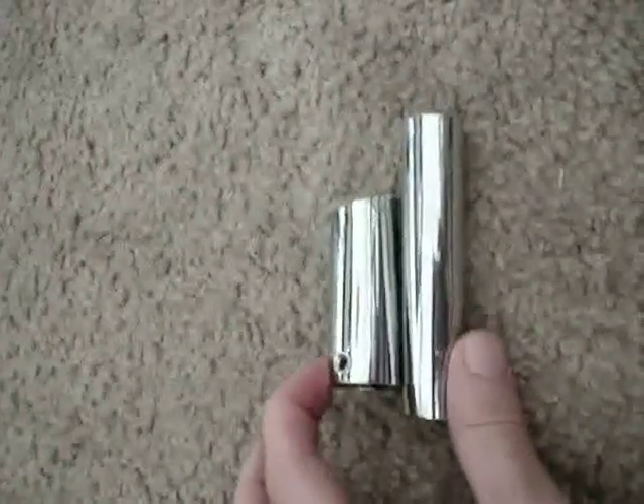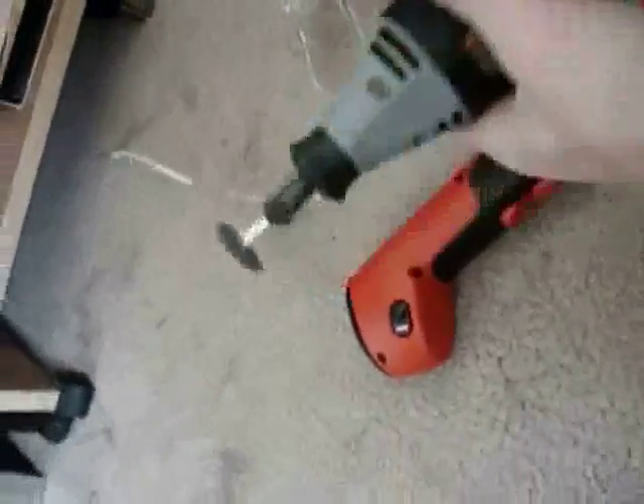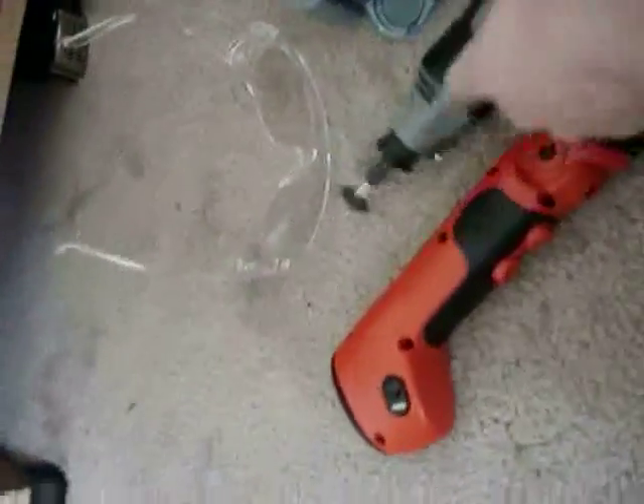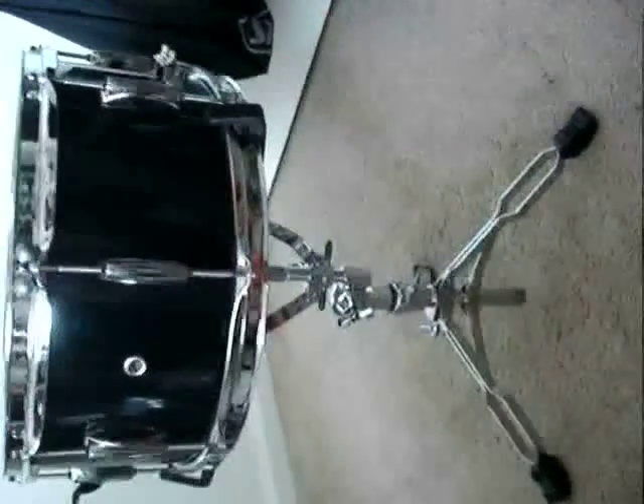So if you're looking to spend just an hour — maybe even less if you've got the right equipment — you can drop your snare stand a bunch. When you cut it, you're probably going to want to do about 3 inches on the top part. I did 3 inches on top and 2 on the bottom before I really knew how much I needed to take off, so I'd say do 3 inches top and bottom. I didn't touch up the edges yet, but if you want to, a Dremel tool is the way to go — just get the right attachment. Hoping this video is helpful to anyone who wants a lower snare stand.